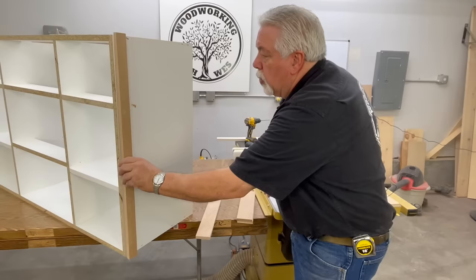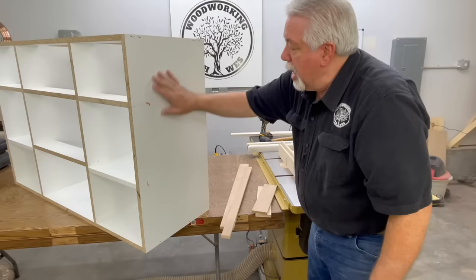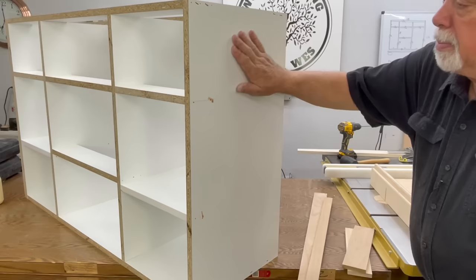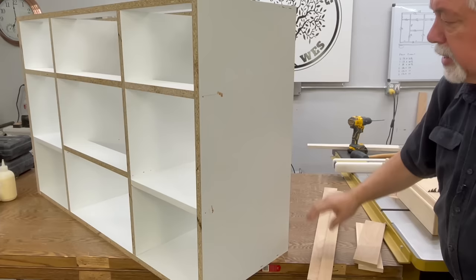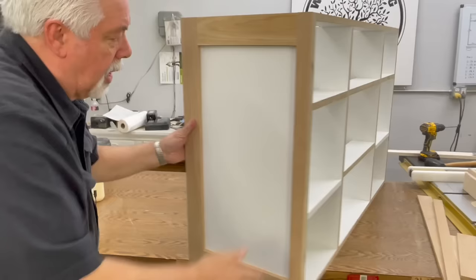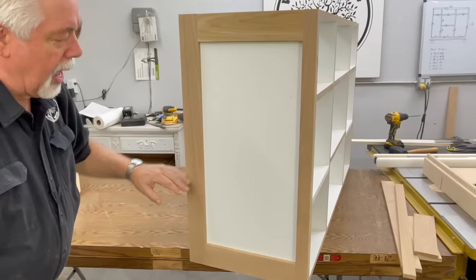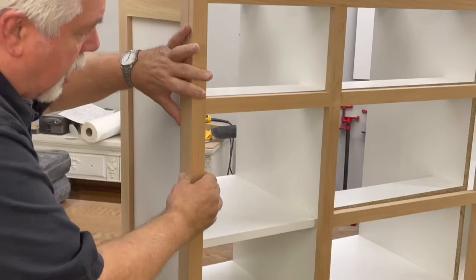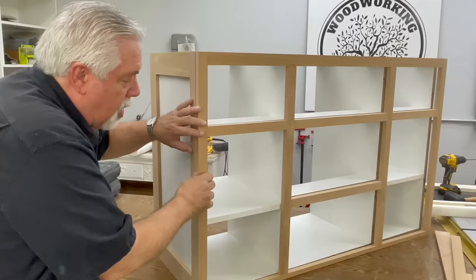Here are the strips I'm going to install. We have a narrow one up front, a little bigger one in the back, and a three-inch top and bottom. We're going to sand this surface and fill two nail holes before we apply the build-up on it. The reason is this is going to be a painted cabinet, and being white melamine, it makes a really good paint surface — but you have to sand off the factory melamine finish before the paint will adhere to it. I went ahead and did the other side so you could see what it would look like, and this is what our paneled end will look like. Our inch-and-a-quarter wide face now covers the seam and the raw edge of our melamine particle board and makes a finished edge.